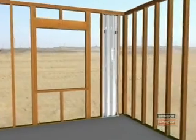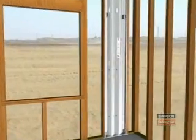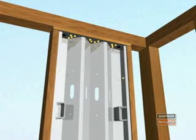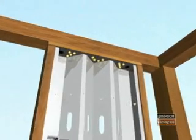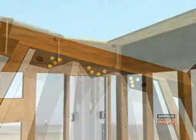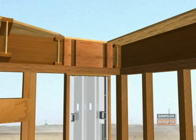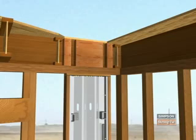To begin the installation process for a two-story stacked wall, first install the bottom wall using the standard wall installation instructions. Drill a 1 1/16 inch maximum diameter hole through the shim and the top plates at the holes in the top of the steel strong wall. This will allow the threaded rod to pass through. Install rim joists and solid blocking the full width of the steel strong wall. Allow space for the threaded rod to go up through the subfloor.